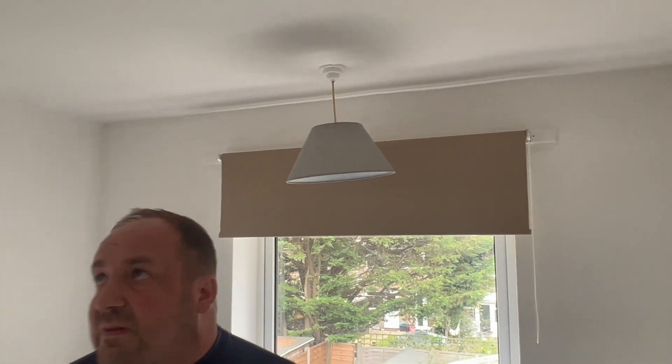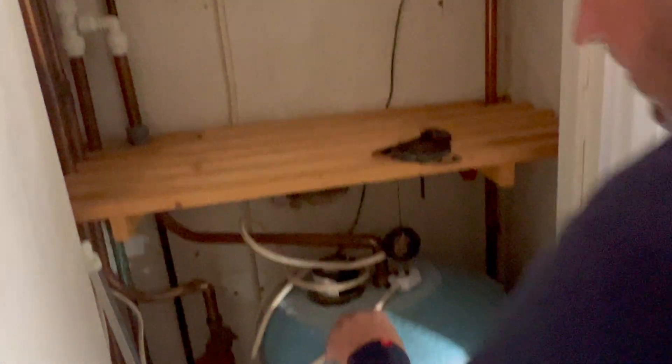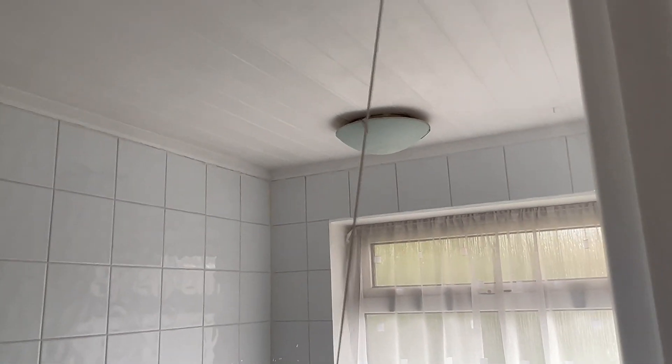You can see by the top ones that they're — well, that's horrendous. Metal light fitting in here. Also, that's obviously for this shower that's in there, the immersion on the pipe top. It's absolutely horrendous. You can see the top of it is metallic — class one, whatever you want to call it — in a bathroom. And there's even a light fitting in there.